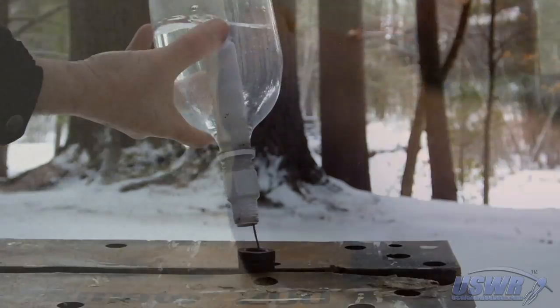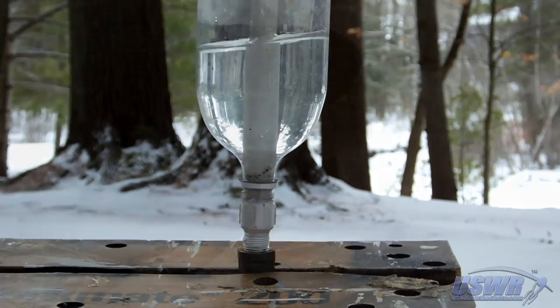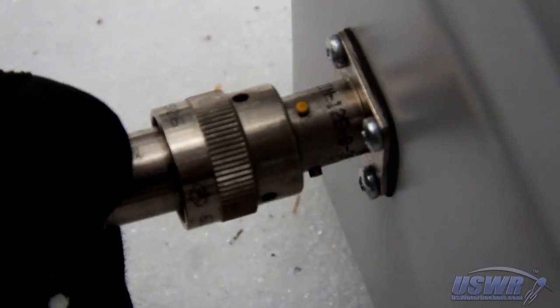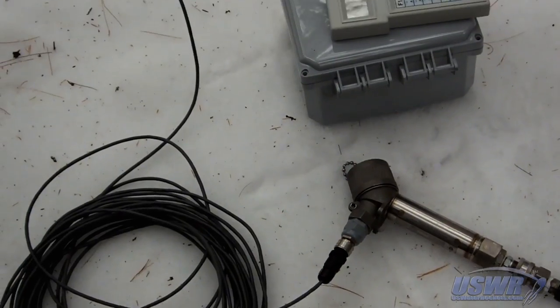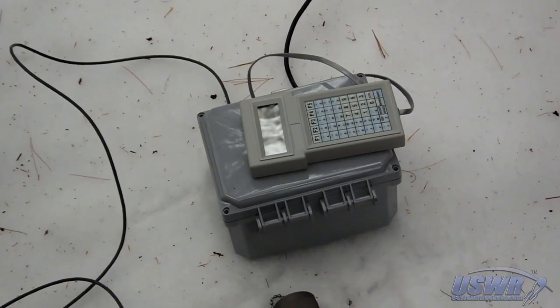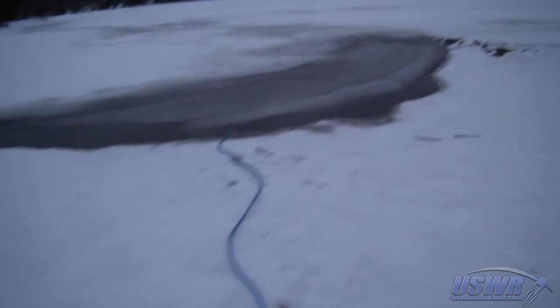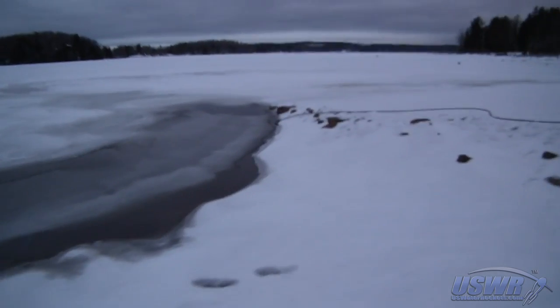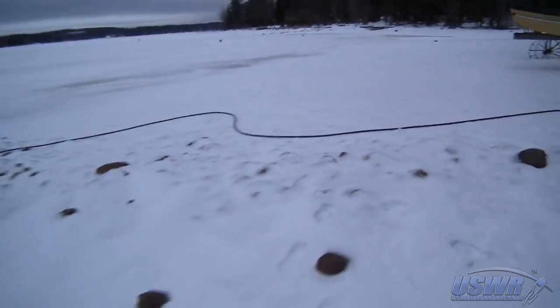The simulated water rocket test bottle was installed on a test rig, which we clamped securely into our workmate. A pressure transducer was used to measure the pressure inside the bottle, and this was connected to our logging system for later graphing and analysis. We made an effort to reduce the potential heating effects of the compressor on the air by passing the compressed air through 100 feet of hose, which was in thermal contact with the ground. The intent was to try and dissipate the heat of the compression using the ground as a heat sink.